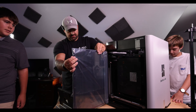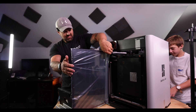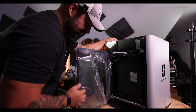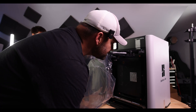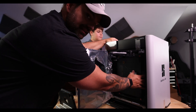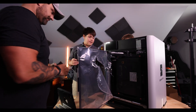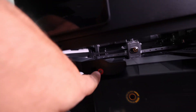What's a safety key? Is that like when it shuts it off? Yep. So it can't be used if I don't want it to be used. I'm going to leave this plastic on here until the end so I don't get as many fingerprints on it. So it looks like we got one, two, three, four screws on here holding the AMS in place — these red screws here. There's also some tape right here going all the way through the bottom. So these are the red screws on the inside — there's one here, here, here, and here that we're going to have to take out.